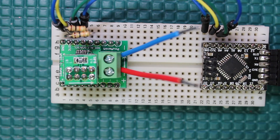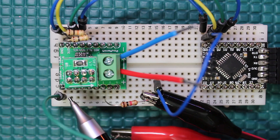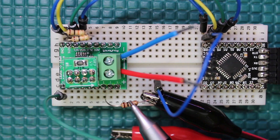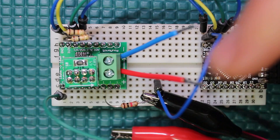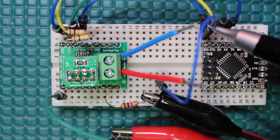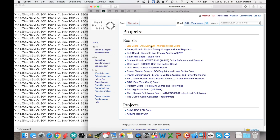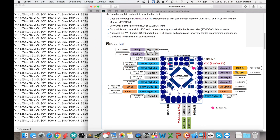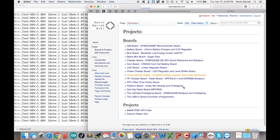Now I've got the source measure unit hooked up — the positive lead connected to the positive pins, the negative pin hooked up to our load, which is just a 1kΩ resistor, and then the negative lead on the other side. I'm also making sure we have a common ground throughout the system, so I grounded that negative lead to the ground of the microcontroller. On the 328 board, analog 4 is the I2C data line and analog 5 is the I2C clock.